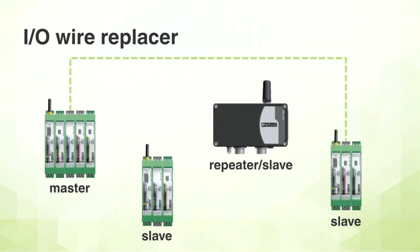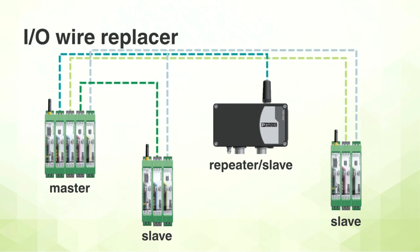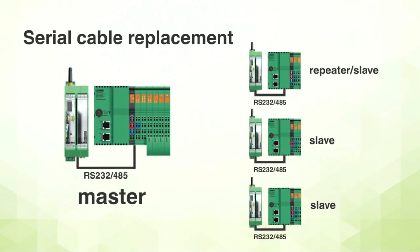Use it in four different modes. One: Radioline can be used to transmit I/O signals from many locations, and can even be used to duplicate signals at multiple sites. In I/O mode, Radioline is like a cordless terminal block. Two: in serial data mode, RS-232 and RS-485 interfaces can be transmitted, replacing faulty bus cables or connecting remote assets where a serial cable cannot be connected.